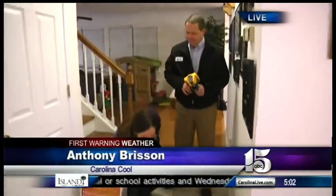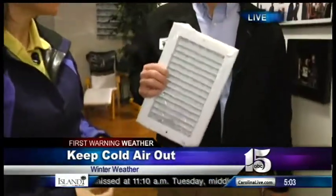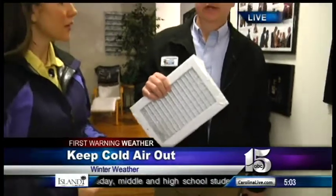Okay, and you also mentioned something. Upstairs we have the registers on the ceiling. And those actually don't pump down the heat? Well, on the typical register that we get, we've got about 4 feet of throw, so during the heating season, the air is only coming down about 4 feet and going back into the return.